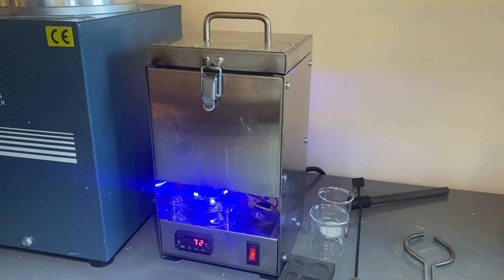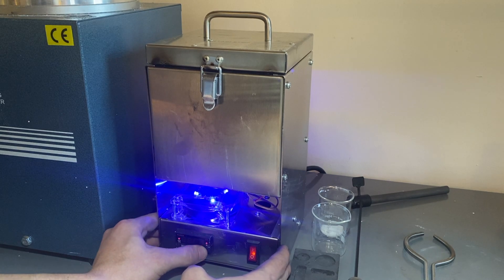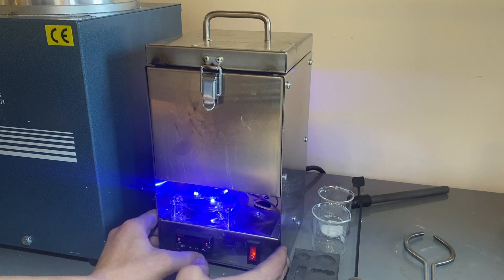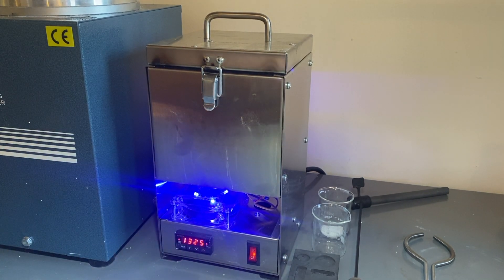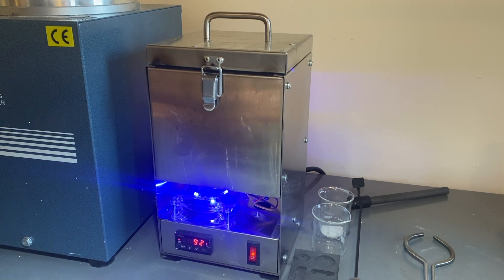It's literally that easy to turn it on. The current temperature is 72 degrees Fahrenheit inside. We're going to set it to 1325. This furnace shoots over a little bit — typically about 25 degrees — and I want it to be about 1300, so I'm going to keep it at 1325. We'll come back in about 30 to 45 minutes. Once it's heated up, we'll check in on it, add some borax, and then pour it into the mold.